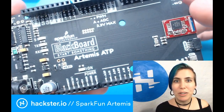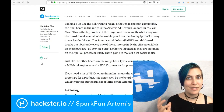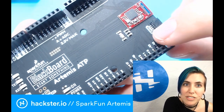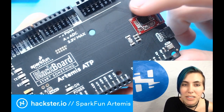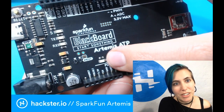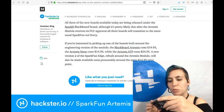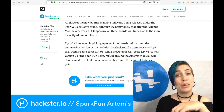Even though it's a giant board, it's still powered by this teensy weensy module and you can run it off a coin cell — isn't that cool? This breaks out all 48 of those pins available on the Artemis module. All the pins are kind of jumbled together because they're arranged in the same way they are on the chip itself — parallel lines. You've got your LED on pin 5, transmit and receive indicator lights, and a power-on indicator. As Alistair points out, this is the one you'd use to really test what your actual product might use, since everything is broken out. He closes with some pricing information and a note that these boards will probably turn red once they're in the certified production versions.